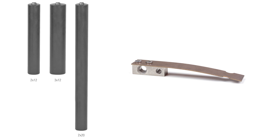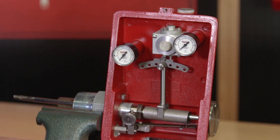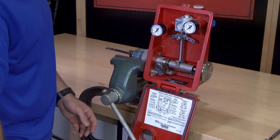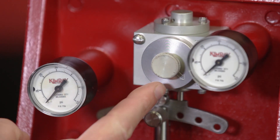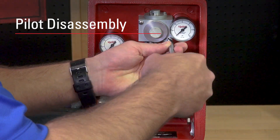If you're repairing the pilot or need to work on the tangent arm, start by mounting the unit into a vise. Open the case and inspect the gasket between cases for rips or tears. Mark which hole the tangent arm is in and note whether it's in snap or throttle mode. You could also take a picture for later reference. Now we'll begin with disassembly.